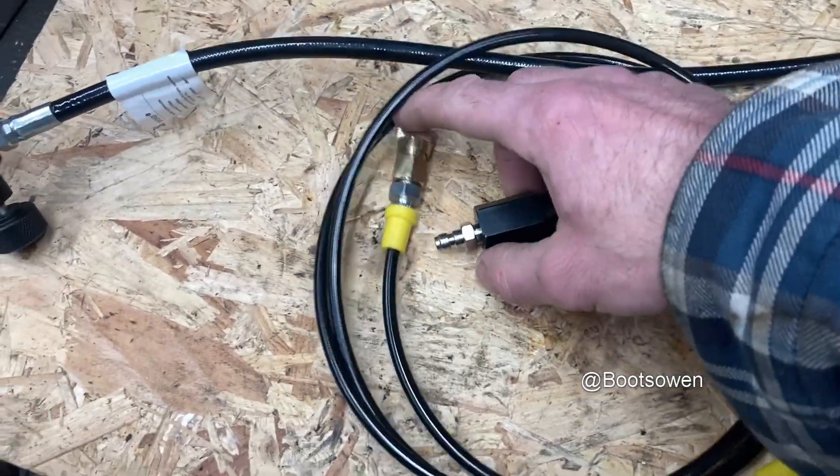What's going to happen is whenever I drill into it, it's going to make it harder — it's going to tighten in there. It's bearing up; actually I don't really want to do it that way. It's going to snug up against a rubber ring and crush it. I was going to use this as my holding device, but I need a shot of compressed air to blow all the brass dust out. I've got it very loosely chucked in the lathe. I realise there's a potential for this to go very badly wrong. Let's turn the lathe on slow.